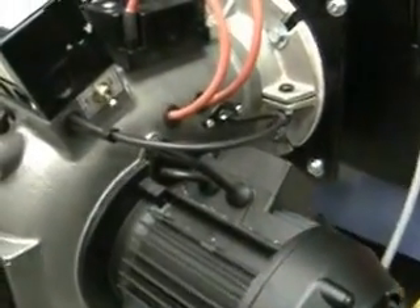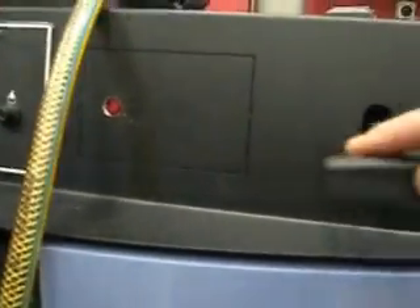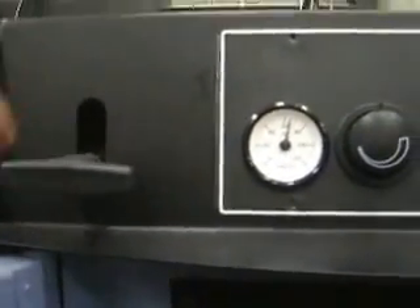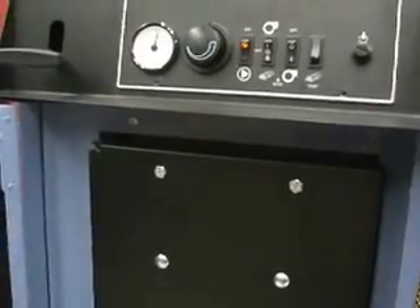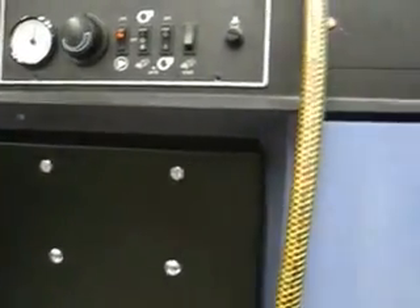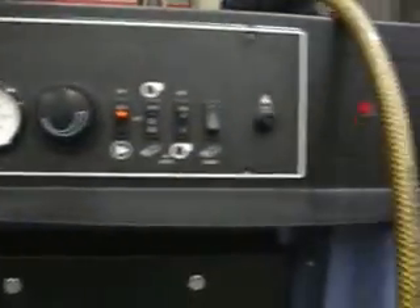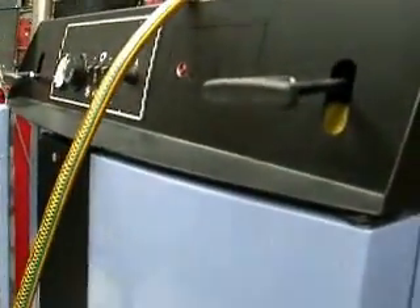In another video, we'll show everyone the inside of this combustion chamber. Just going back up the top, these handles here — one on the left, one on the right. What these do is move a helical coil inside the vertical fire tube so that the internal heat exchanger fire tubes for the timber side and the burner side are not exactly self-cleaning, but will remove the soot that's inside the vertical fire tube. Soot then just drops to the bottom and has to be cleaned out.